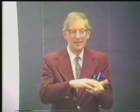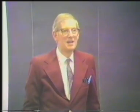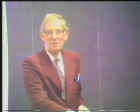Now, I'm convinced it was due to the fact that we had these twisted blades, and they were too coarse. I'm convinced they were too coarse at the tip and set off this oscillation. But as I say, it only happened once in a blue moon. I think we had it once in about 4 or 5 years of flying with the old blades, and it just wasn't recognizable as being a problem at all. Because we reckoned it had to do with excessive flapping of the blades. That's right. And this aggravated the flapping, I believe.